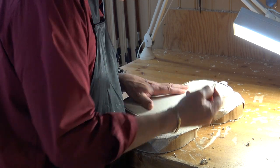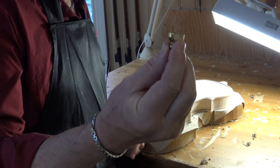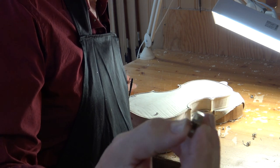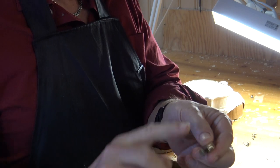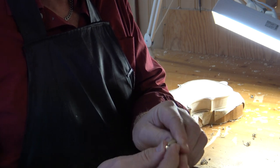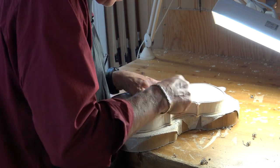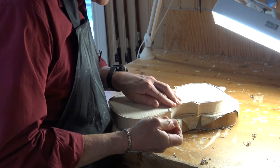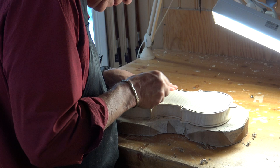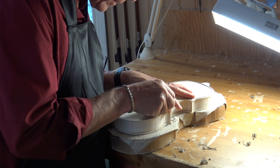So, we do it this way. This is a handy plane. If you see it here, I worked the edges of it, so the blade goes really close to the edge and then it's scooped like a gouge — this is like a gouge plane. As I mentioned before, I love to plane; I think it gives me good control over the process of taking away the wood.